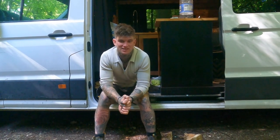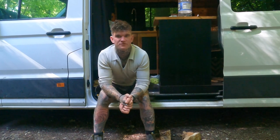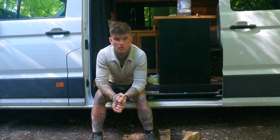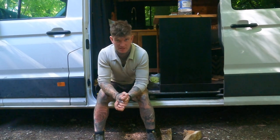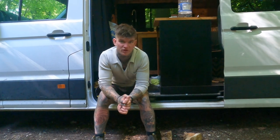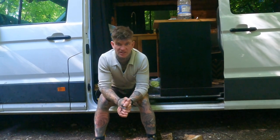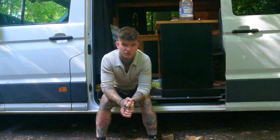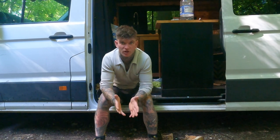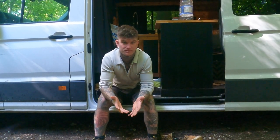But yeah, with bricklaying on price, it is not what you can do in the big lifts, it's what you can do in the shit lifts that really makes you any good at your job. Because anyone can chuck up a third lift or a first lift, but the problems you come across on the second lifts and the fourth lifts and the gable ends, and how quickly you can deal with them and how well you've done your first lifts and your third lifts, is really how well you're going to earn in general as a price worker.